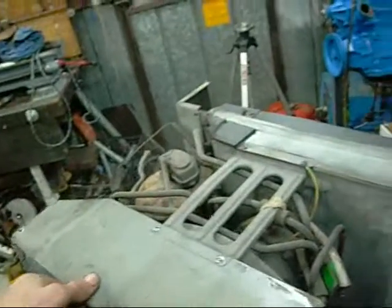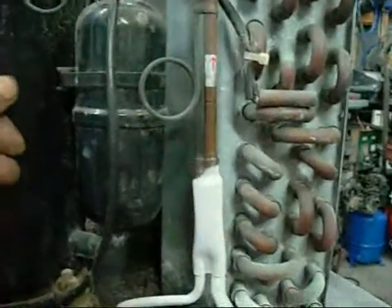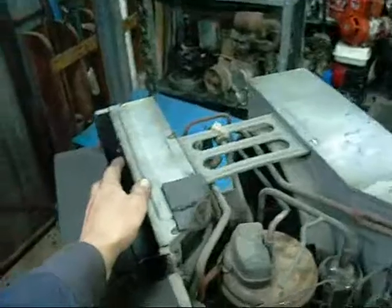The other thing is they've got the top off here, so we're not getting full evaporation either. I'm forcing it to really freeze up. You can hear the compressor is getting a bit noisier as the head pressure comes up, as the whole thing tries to vibrate. Compressor temperature is slowly coming up, and so is the air temperature coming out of it.